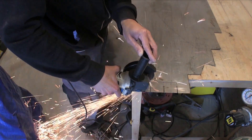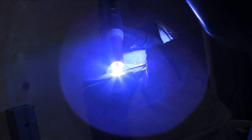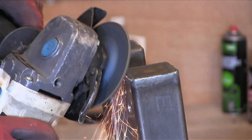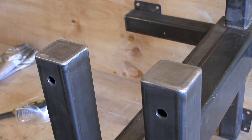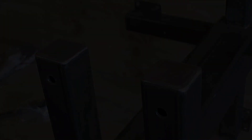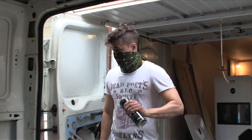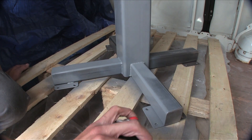The stand ends were open, which I didn't like, so I busted out the TIG welder and capped them all. Once they were smoothed down, the stand was ready for paint. Using my old van as a spray booth and looking like someone from GTA San Andreas, I primed the stand with some high build primer and then sprayed it silver.